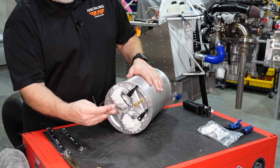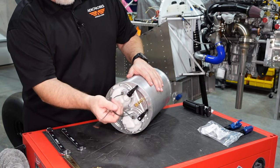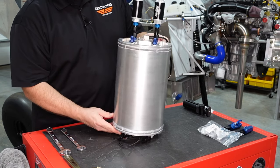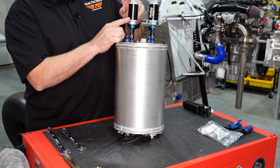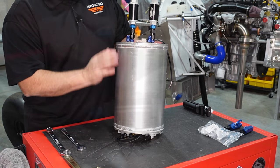And same thing here, we'll extend those fuel pump lines, add some wire to that, and those will also terminate on that block. And then all of our cables will move forward. So that's what we're working on now. We'll go ahead and get the thread locker on these two fittings, the AN fittings going in and out of the fuel filters. And then we can lock this down and then get this tank mounted inside the cabin.